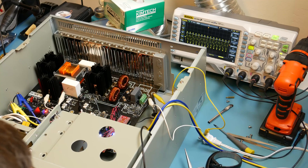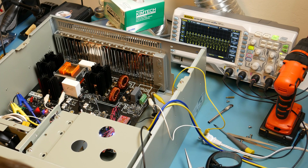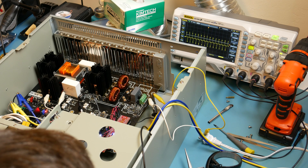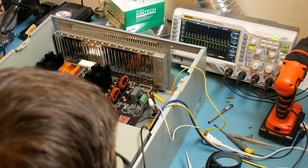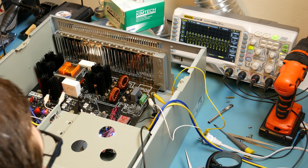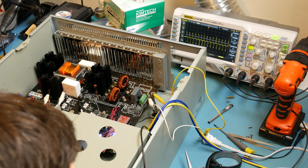Furthermore, we have isolated amplifiers and Hall effect sensors that measure output voltage and current, each with their own phase delay. While I tried to compensate for all of this, I never quite got there, causing some wicked instability in the control loop. The control loop was tuned and stable in theory, but phase delay really wrecked that — and it was only stable when the inductor and capacitor values were precisely known.